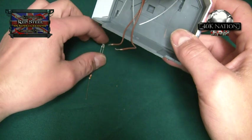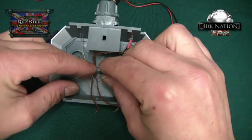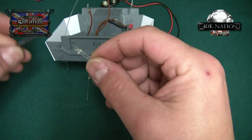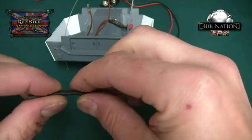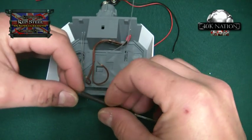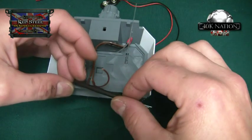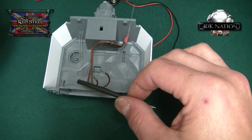I will use a second LED. Basically all of these fibre optic wires will be bunched up together like so. Then I will get the LED and with the heat shrink, I'll heat shrink completely over the bulb itself and all of the fibre optic wires. They will feed into the tube and butt up against the surface of the LED. So when there's power running through it and the LED lights up, all of the light will travel down all of the fibre optic wires and come out at the ends to a tiny pinpoint light. In theory.